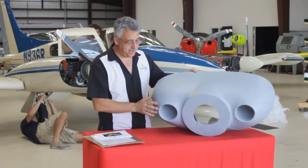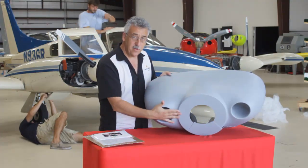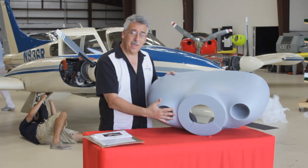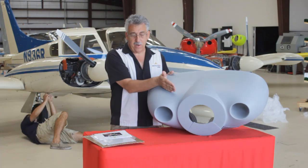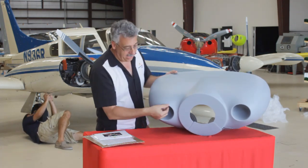Let's look a little closer at the nose bowl. You have a better shape — we've pulled the inlets farther forward so it's closer to the back of the propeller where there's higher energy air. So we make better performance and get better use of that air. The old stock nose bowl was laid way back and it lost a lot of that extra energy.